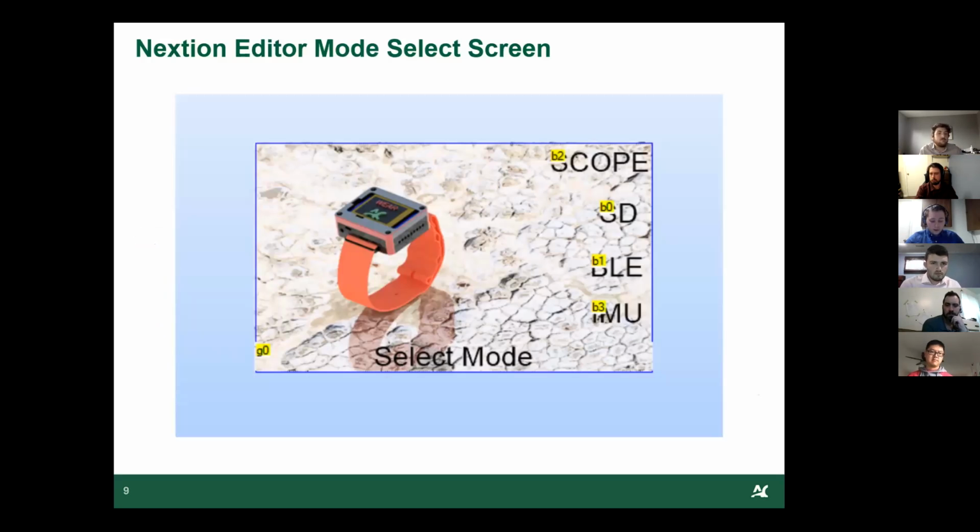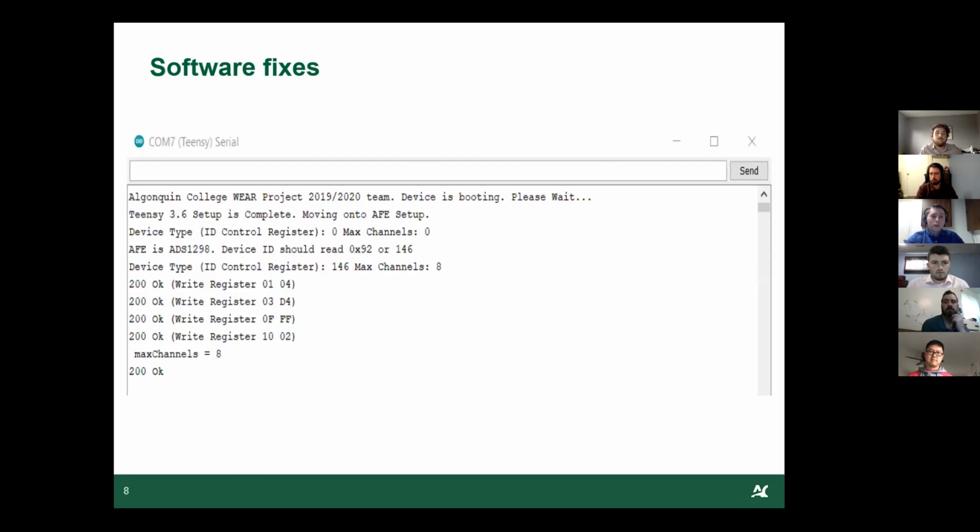The final software has two revisions that we want to talk about: the PCB prototype and the prototype utilizing the ADS1298 development kit. We created two of these because the PCB has just a few minute changes compared to the other revision. Namely, the location of some pins. The buttons to control which mode you're selecting, we wanted to put in a spot on the PCB that was a little more accessible. So that changed from that revision to that revision.